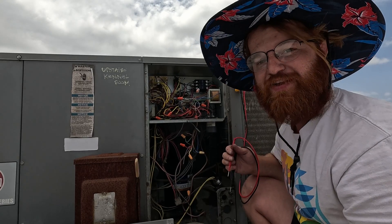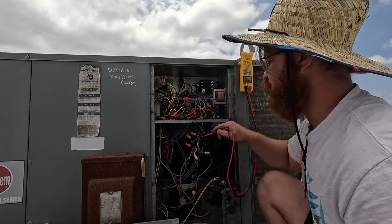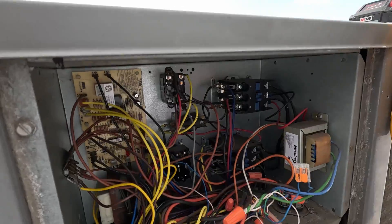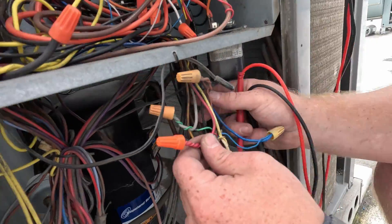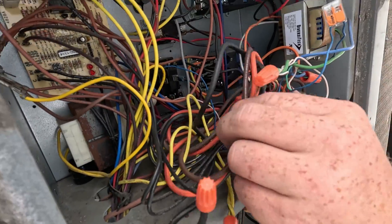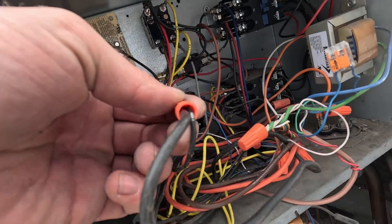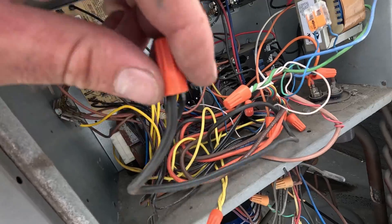Now we trace backwards. Our hot wire goes back in here — it's just a hot mess when you have a system like this, so you want to be a little bit careful because some of these could be live high voltage wires. Be careful for loose copper coming out too — some people don't trim them well and you'll get zapped just by picking it up.